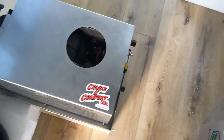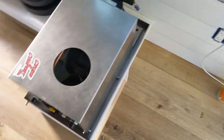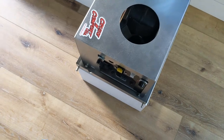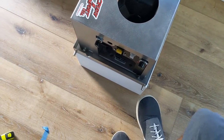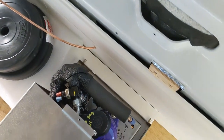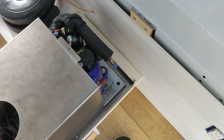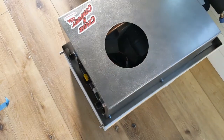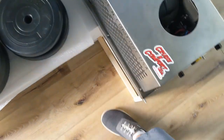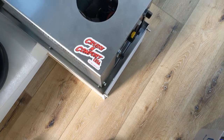Because this has the condensation tray, which is not required but recommended, I did 14 by 26. You can see the little drip holes right here and there, and there are also two more in the back. I'm going to run four clear plastic tubes straight down outside.